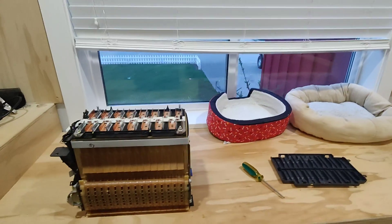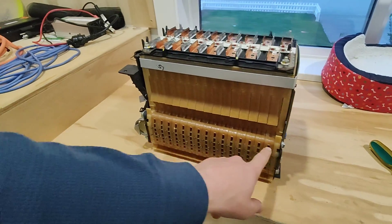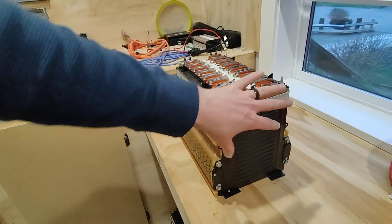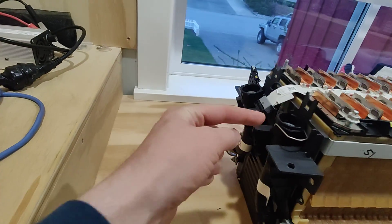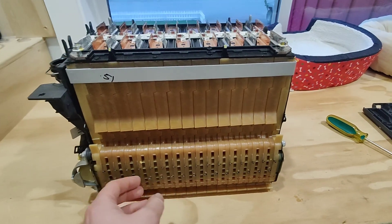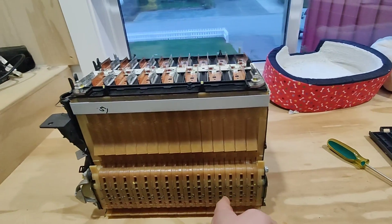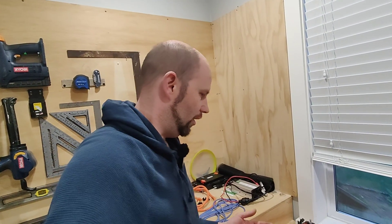What we've got to do is pull out the main nuts and bolts that tie everything together — you can see these ones run all the way through. The bolts are at the bottom end, and there are no bolts up top, because that's where the coolant channels are. You can see the two coolant lines — one in, one out — running down into there. Each one of these cell packs is sealed to the next, so there are actually a lot of potential points of failure here. There's probably still some coolant in here, so I'll get some rags and start disassembling.